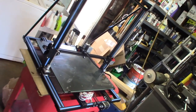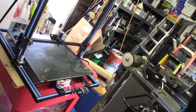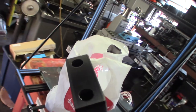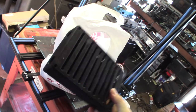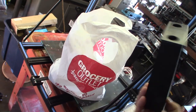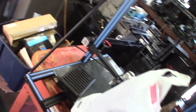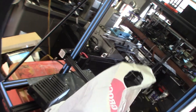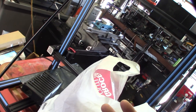I'll show you what he's done so far. He's already printed out my under-mount kit — what that does is it takes all the stuff out of that control box and mounts it underneath. I originally designed a box for this. It's all on my Thingiverse page. It mounts a board in the case — for this printer I designed it for an SKR Mini E3 board, which I think is a much better board than the Creality board. Creality boards don't have an EEPROM, so you can't save Marlin settings to a dedicated EEPROM — it saves to the SD card instead.